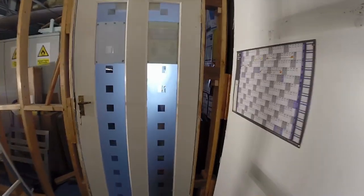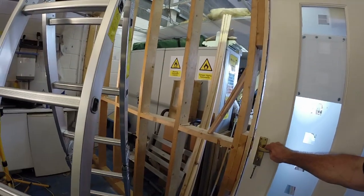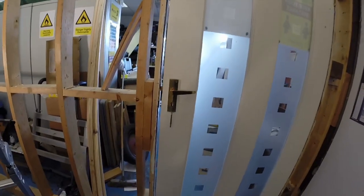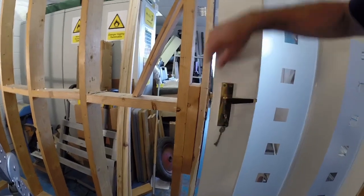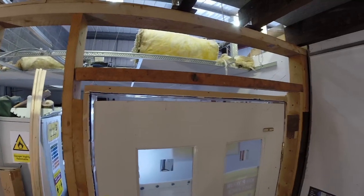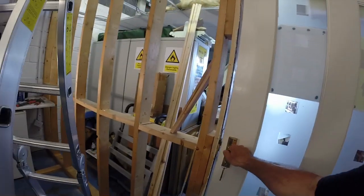and finish that. I've just popped in for an hour or two while the lads are off. They'll be back at the end of the week. Sort out a couple of things I noticed. The door that they've put back in, there's a bit of a big gap down there, and that can be sorted relatively quickly by just taking out three screws and pushing it across, packing it, sorting that out. And I've also just noticed that the head isn't exactly quite what I'd wanted. So we'll get that sorted, and it's easier to sort it now than after we plasterboard it, because then it's a finished job. So we'll just get that sorted.